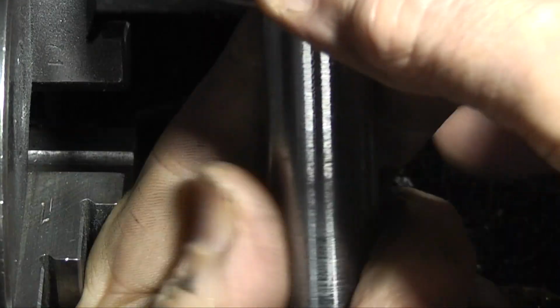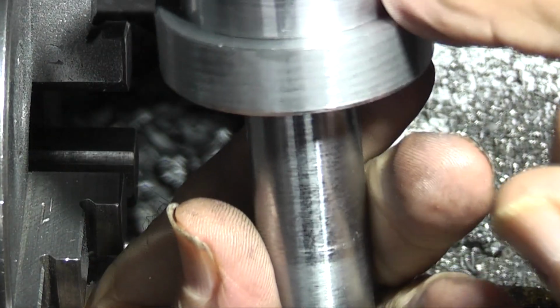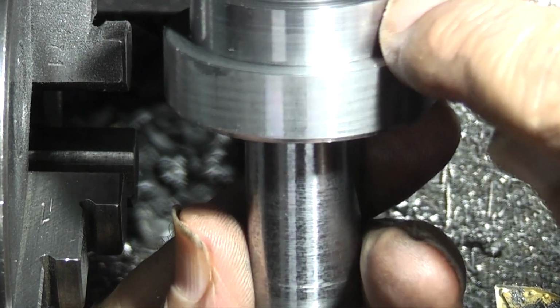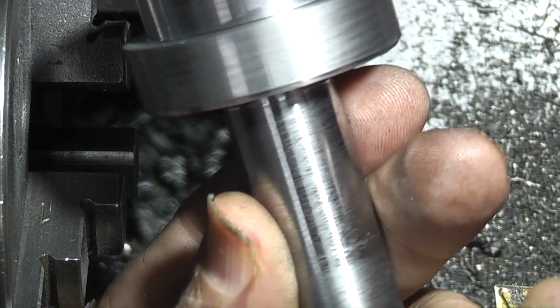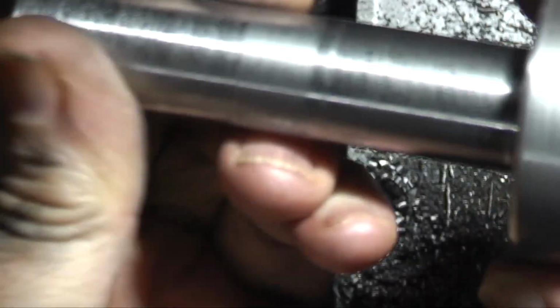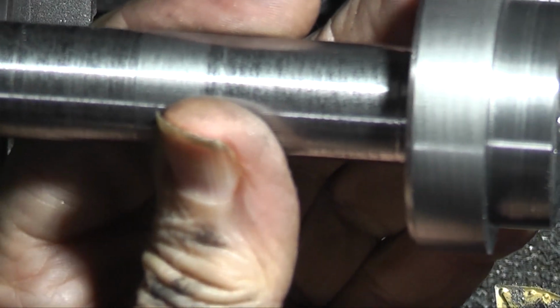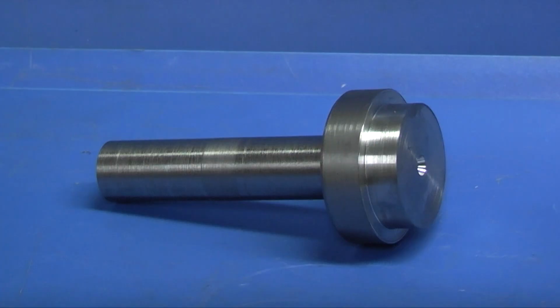That's what we've got so far. Blank piece there for the Morse taper. Blank piece there for a 1.5 inch 18 UNF. Centering each end. So now I can set this up between centres, turn the taper and then cut the thread. And we'll finish that off next week.